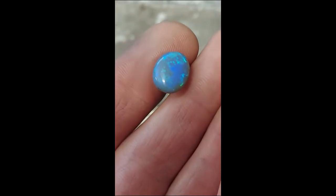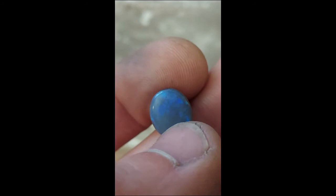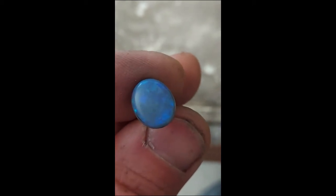I've gone through the 1200 grit and I don't see any... well, there's a little bit of black right there towards the tip, and there are these two little black spots here and here. So I can go just a little further. I've got enough fire here and there's enough depth that I can still cut a little deeper to get those last two little nicks out, and then move on to the 3000 grit.